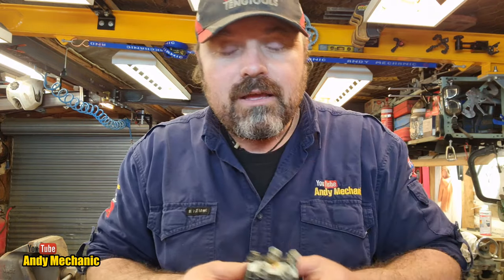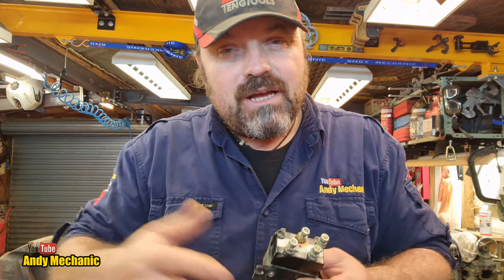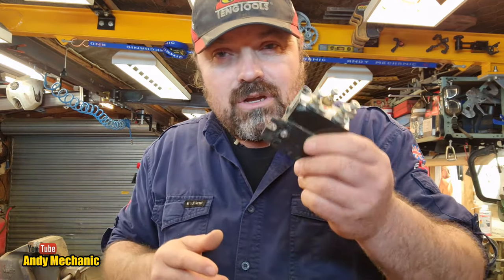There's been a huge increase in the number of winches fitted to ATVs and ROVs — the side-by-sides. My background is four-wheel drive winches — WARN, Super Winch, that kind of stuff. Whenever we install a winch onto a four-wheel drive, we would always install what we call a battery isolation switch, so the main feed — the heavy cable going to the solenoid block — would have a big high current switch in it. That way when the winch isn't in use, we can de-energize that circuit so there's no power being fed to the winch or solenoid pack.